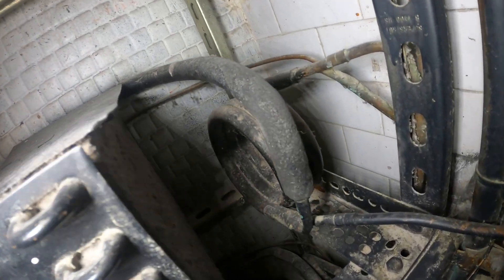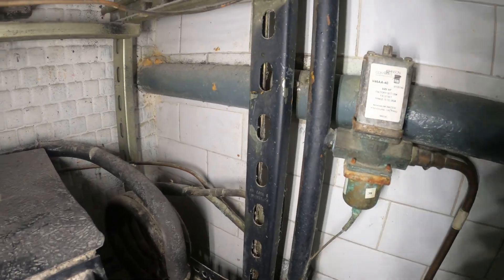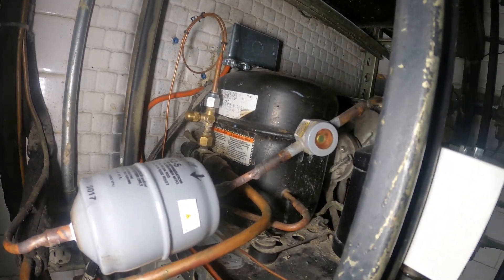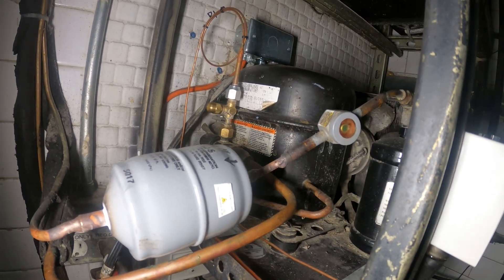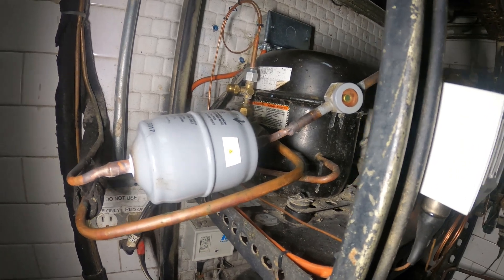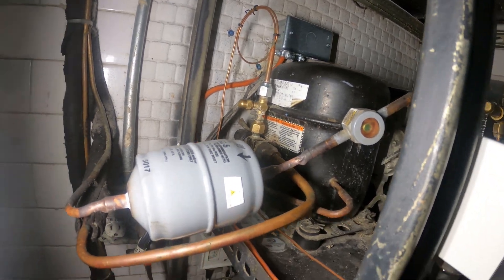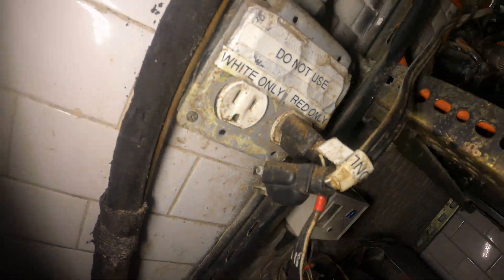This is actually a water-cooled split system. That's our condenser coil right there — water-cooled condenser coil and water regulating valve. The reason you want to turn off your condensing unit while doing an evaporator fan motor changeout is that if you just kill power upstairs to the evaporator fan motor and the condensing unit is still running, you're going to have a frozen coil. So that's unplugged.